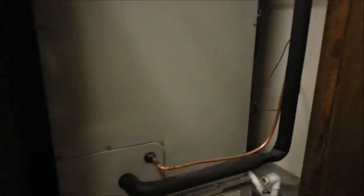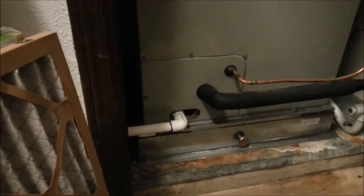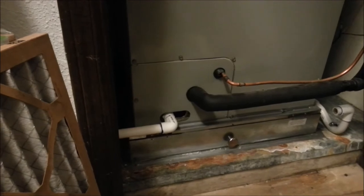So I'm tripping out, and I'm opening it up, checking the coils, checking the outside unit. Everything looks fine. I'm checking the condensate line — it wasn't clogged up, but I sucked it out anyway.